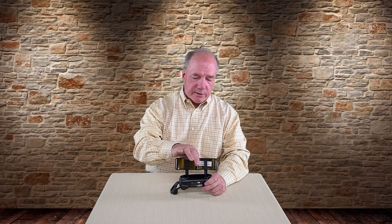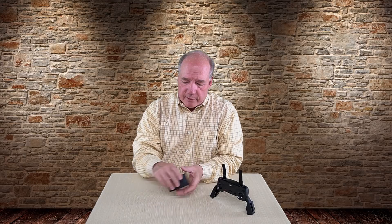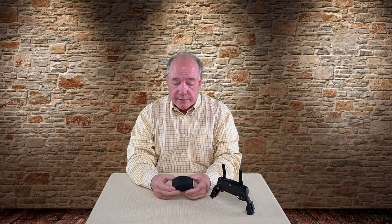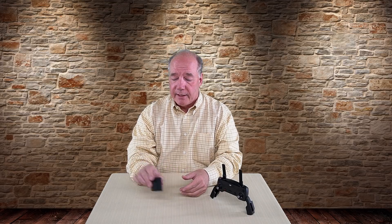They go on and come off very easy, and what I really like about this set is that they fold in half for a very small footprint in my case. I've done a lot of testing on this — this is a very solid physical principle that's been used for ages, in flashlights, dish antennas, and cellular towers. What I notice mostly is not that I can fly twice as far, but that even when flying in close, the additional signal strength lets me avoid breakups when there's an obstacle between me and the quad. Where I used to get dropouts flying in a heavily wooded area behind a tree, this passive reflector eliminates those. It also gives a much more reliable signal at distance.